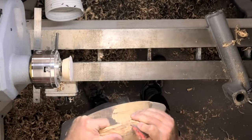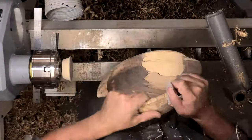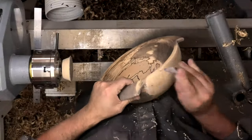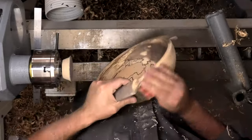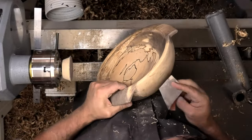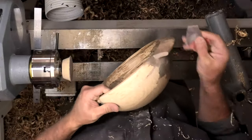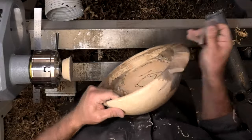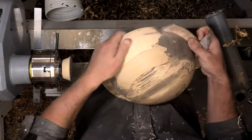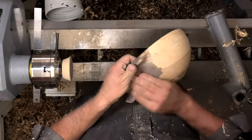We had a question which I think has potentially been answered by everybody on the chat. But Elizabeth asked, could you cut the edges, the excess wings off on a scroll saw? She doesn't have a bandsaw at the moment. Yeah, much friendlier, safer way of doing it, absolutely. But the same thing, though, keep the wings low. Don't have the bowl stood up on it in its normal axis like this. Have it upside down. I'm very hesitant of not having it supported when I'm working on them.